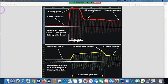And Mike, I'm not surprised that you came up with something like this, by the way. This is great. It is so much fun because basically this uses a lot of audio gear. Many people know I'm a pro audio engineer. If you look here, you can see my little cursor on the top. This is the inrush current that you get. Now, these little wiggly lines, that's actually the 60 hertz cycle. You've heard about 60 cycle AC, 60 hertz AC? Yes. That's what we're seeing. I'm basically measuring the hum of this system.